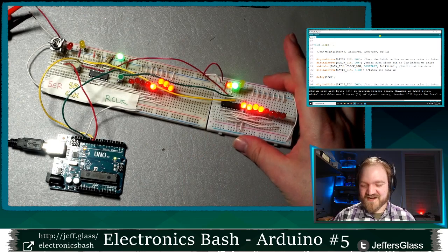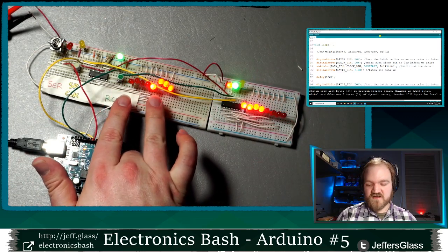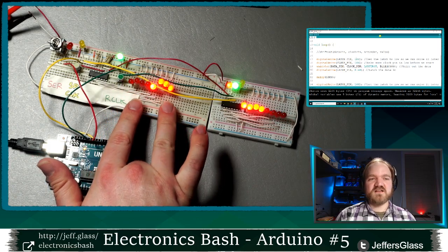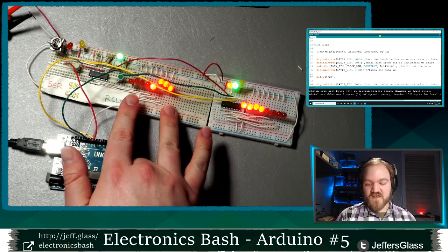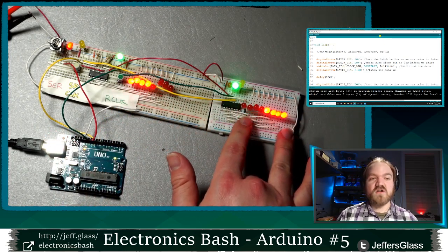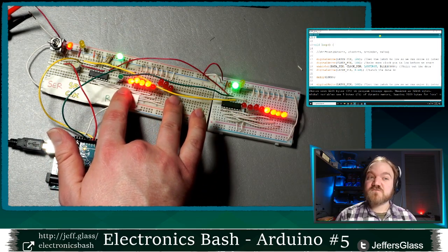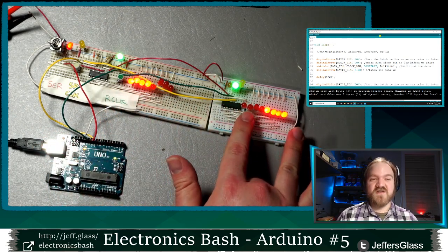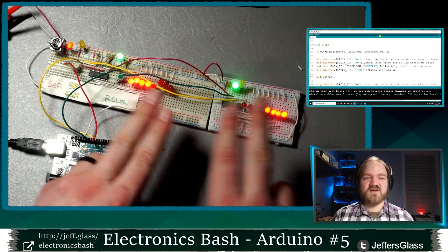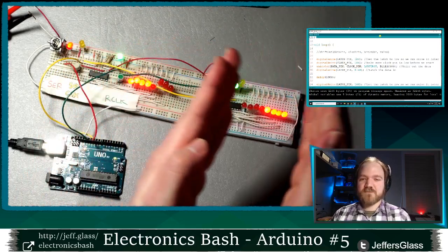So now that things are back in shipshape order, we can see that we're clocking in 1111000, and then latching that information in, and then clocking in the reverse of that and latching that in. And of course, those values are carrying over, right? They're passing through to our other shift register here. So when this one has its 8 new bits clocked in, those 8 previous bits are ending up in this shift register. And that's why they're appearing in alternation. I'm just getting the alternating set of 8 bits one time and then the other.